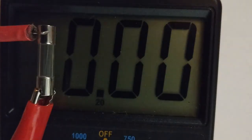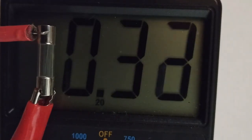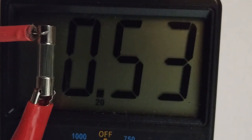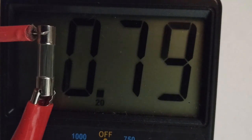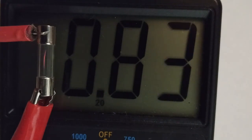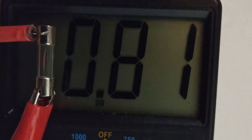Here is a demonstration. Here you can see that at 800 milliamps, the fuse starts to become red, but at the end of the test, without trespassing that current value, the fuse is still working correctly. This unit has current limiting light bulbs, which under normal conditions would not allow a sufficient current surge that would blow these fuses.